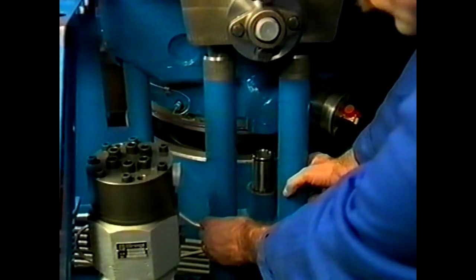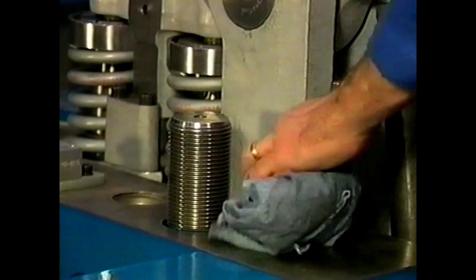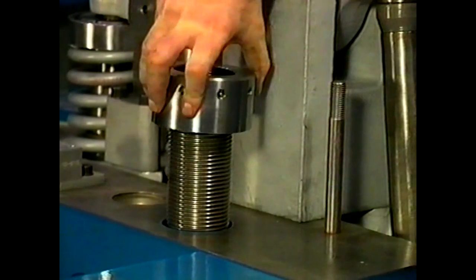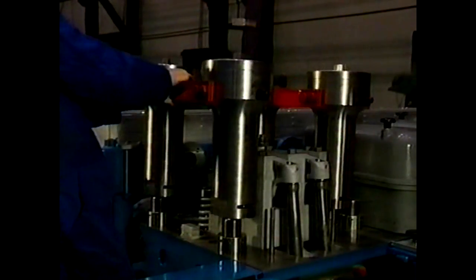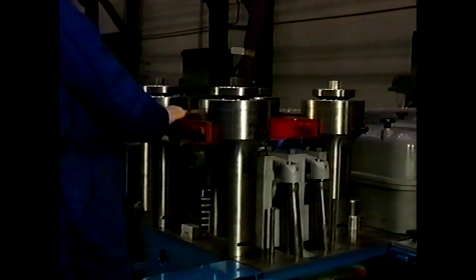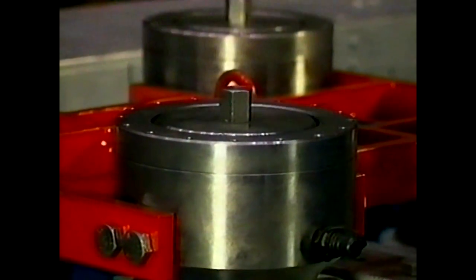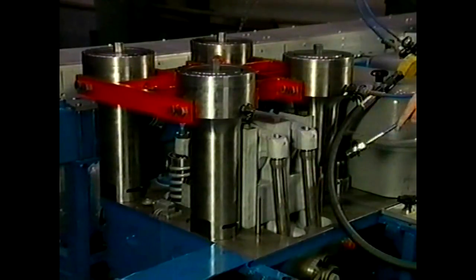The pushrod protecting pipes need to be guided as well until they fit properly in the cylinder head. Make sure that the cylinder head slides easily over the starting air connection pipe. By the oblique position of the inlet and exhaust flanges, the cylinder head automatically takes its position. Make sure that the exhaust flange on the cylinder head fits in the lower clamping piece. Clean the surface of the cylinder head and the nuts thoroughly and check for damage before the nuts are applied. Fit the hydraulic stretching tools again, then tighten the jacks completely and connect the hoses. The return valve on the pump should be opened. Check if the jacks can be turned any further to be absolutely sure they are in bottom position with maximum stroke available.